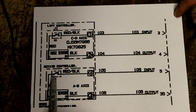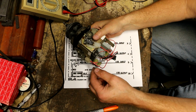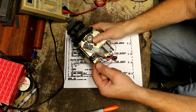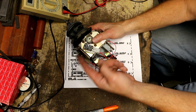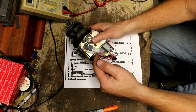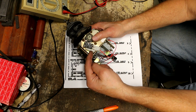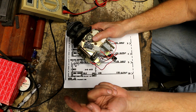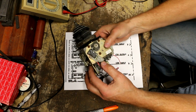That's all it does. So there should only be two wires going to each one of these switches. But that's not what we have here. First problem is this switch only has one wire going to it. We know that's wrong because this does absolutely nothing. So there must have been, and since this is the common tab, something has to connect to here that has been removed. More troubling is over here on this switch.